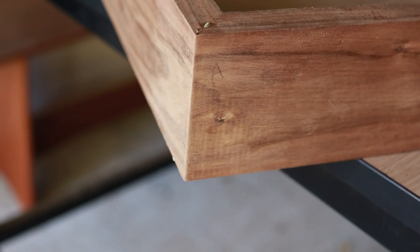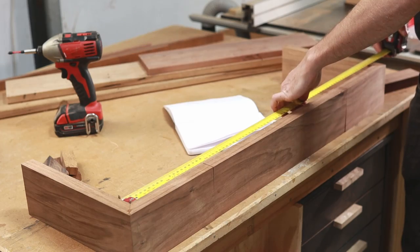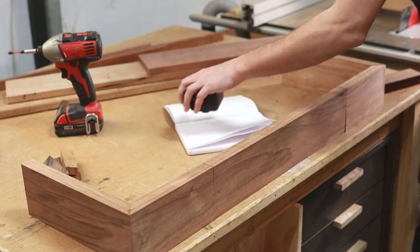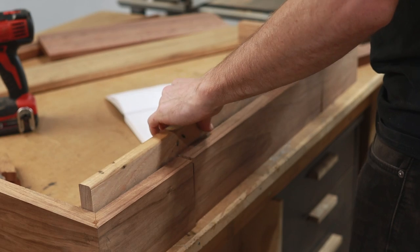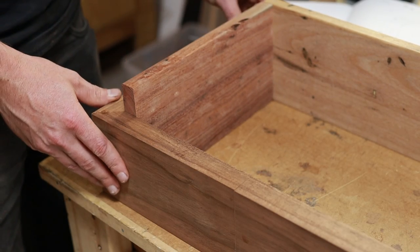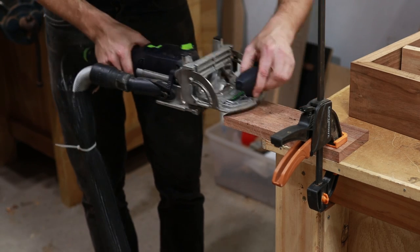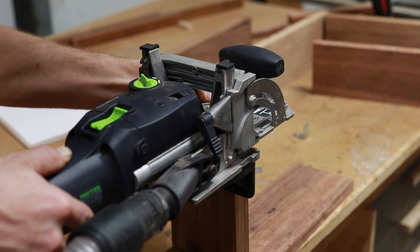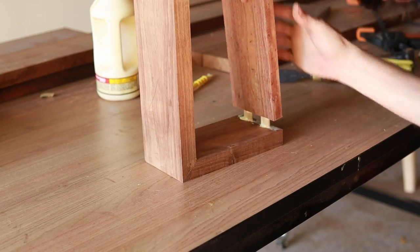This is that grain wrap starting to come together quite nicely - this is what will actually be the drawer front I'm cutting out. The camera died as I was cutting the other side; off camera I cut the back part of the assembly then cut these smaller bits which will act as the drawer supports. After cutting that back panel and these two support panels down to the same width as the rest of the drawer box assembly, I'm using dominoes again to attach everything.